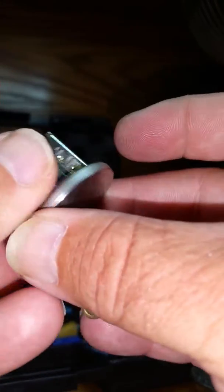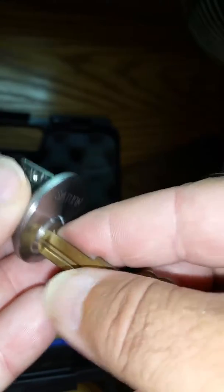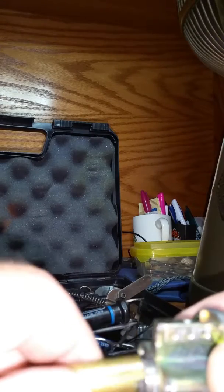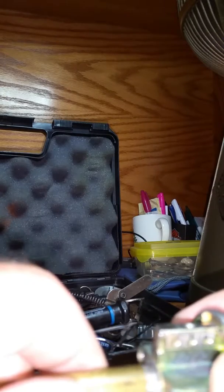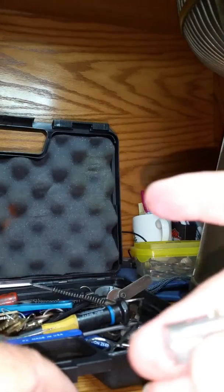It's kind of hard to do here one-handed. Put that back in there — take it just like that. Three, four, and there it is. It's turned. And now what we do is we get a follower. We've got to follow that thing right through there just like that, follow it up. So now we have the top pins and the springs up there — the follower's holding everything in place.